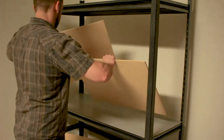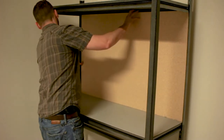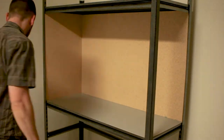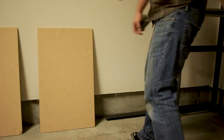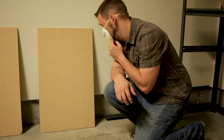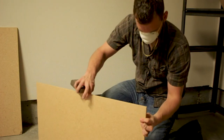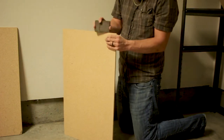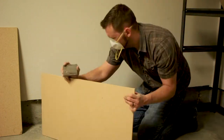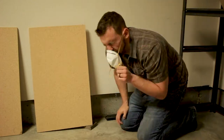I'll just start with a big piece of wood and if I didn't mess up my measurements it should fit together just perfectly. We got the wood in from Home Depot — looks like everything fit just fine. I'm going to take the wood out, start sanding it down and prepping it for primer and paint. I'm using particle board, which is full of glue and resin and all kinds of nasty stuff you don't want to breathe in, so make sure you're using a face mask. This stuff produces a lot of sawdust, but that's why it's so cheap. Take your time with sanding the wood so that the paint adheres properly and you don't end up with splinters when you're handling it.